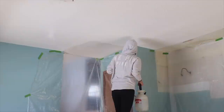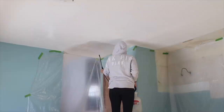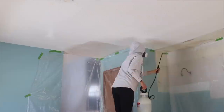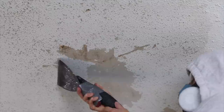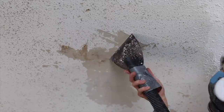So I decided to spray it down again and just really douse it with water. I had never removed a popcorn ceiling before — I had basically just watched a bunch of tutorials, so some of this was trial and error. I thought if I got it really, really wet I could soak through what I presumed was a paint layer holding the texture onto the drywall. I was able to get up the layer of paint and get everything scraped down to the drywall, but because I had to get it so wet, the drywall started gouging. It was almost impossible not to scrape up the drywall because the moisture compromised the actual drywall itself. I would not recommend doing this — it was also a massive arm workout and very, very time consuming.